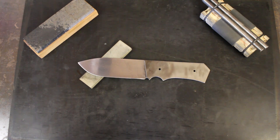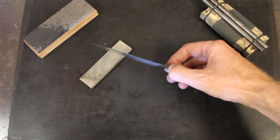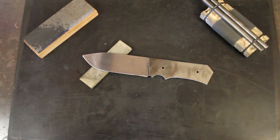This is where progress currently stands. I've got all the black cleared off the blade from the tempering process. I sanded down the blade, sharpened it, and I've got the holes drilled. Basically all I've got left to do now is put the handle on. I still need to buy some epoxy and make my linen micarta, and then I can put it on and shape it.